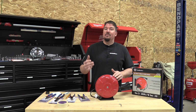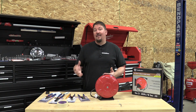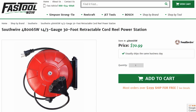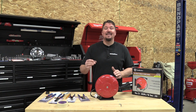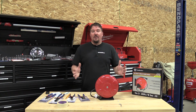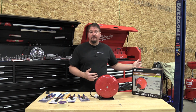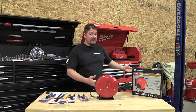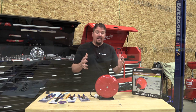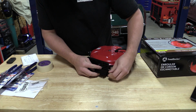Finding a good one is what's going to count, at least in my book. I was all over the web and I ended up at Fast Tool Now, where I found this Southwire model, which is a 14-3 wire and 13 amp rated. You'll find a lot of them out there that are a 16-3 wire and 10 amp rated. However you want to go about it, I wanted something that was quality so that when we plugged something into it, we weren't blowing a breaker, and I also wanted it to reel in fairly easily and nicely. This is where I ended up. If you found something else, post it in the description, help everybody else out.